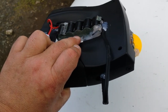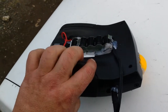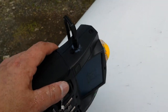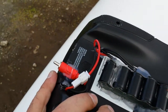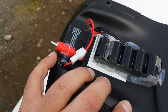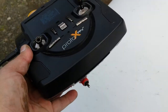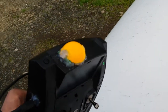Because I don't have a charger that I can program. I've taken a standard 1/8-inch to RCA and hot-glued it in there, because if that moves at all it loses its signal. I've then buried the RCA cord where the batteries used to go, and then brought just the one for the video out right here — that's where I plug in my little goggle set.